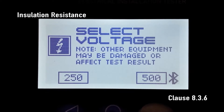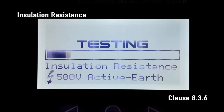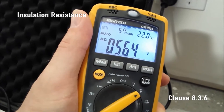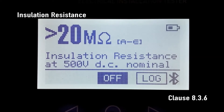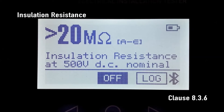Do not use 500 volts if there are sensitive devices connected to the circuit — these devices normally come with their own warning and should not be tested at 500 volts. For today's demonstration we can use 500 volts. Now the insulation is being stressed and we are looking for a result of more than one megaohm. Note that some protective devices can add extra resistance to the measurement and may need to be disconnected for the insulation resistance test.